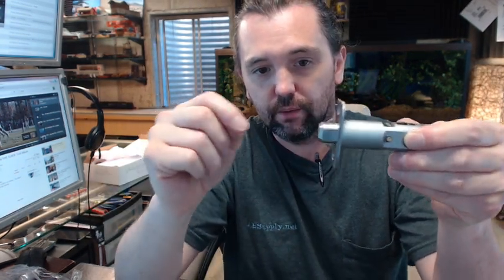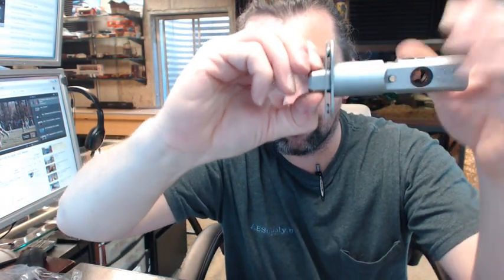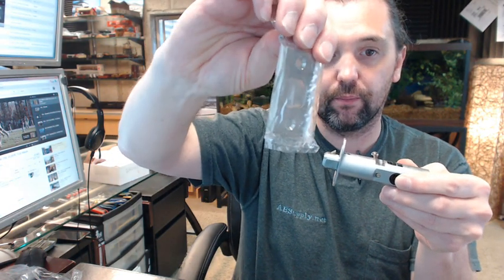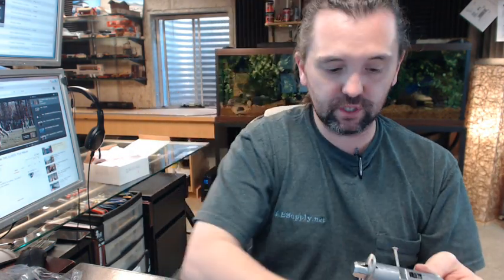This loose part is just the decorative face plate. It is these two little triggers here at the end that do the locking. If I depress those — and I can because the lock is in the unlocked position — when I push the privacy pin in to emulate someone being inside, I can no longer push those down. This is going to slide open this way. When the door is pushed closed it will encounter the strike that you have mortised to the frame, and these two triggers are going to lock on the inside of that strike plate.